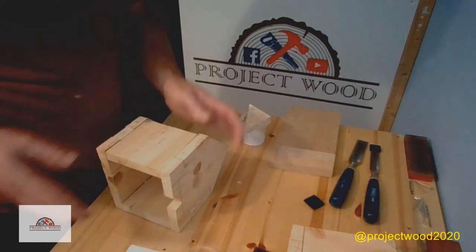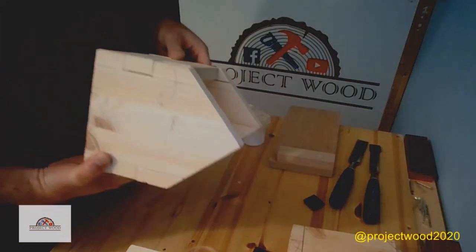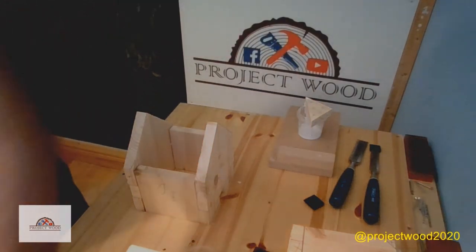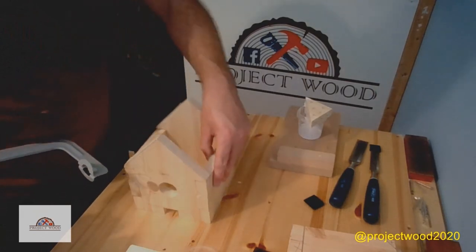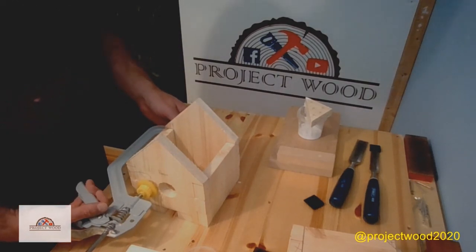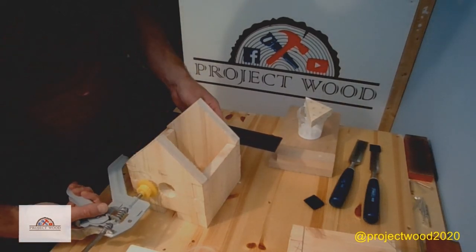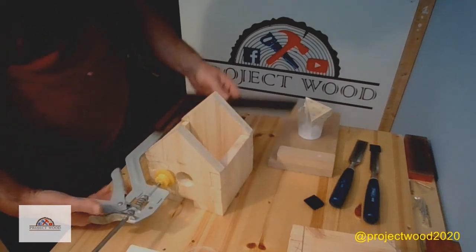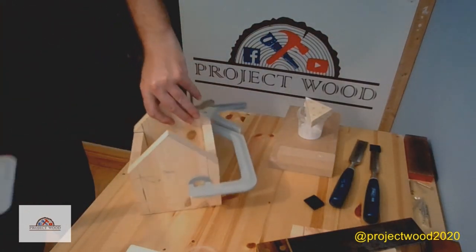Okay, now we have two choices here. If your joints are good and tight, it should glue up and firm up by itself. But preferably, you should get some clamps. Might even fit in your woodwork clamp. And we'll just give it a bit of a helping hand with clamping up our joints. Make sure they're square with your tri-square as you clamp them up. In many cases, the clamp will actually square off the piece for you. That's one. Get as many as we can on.